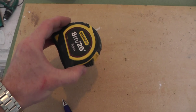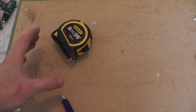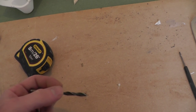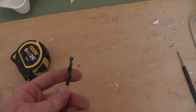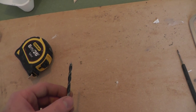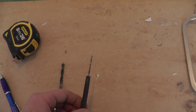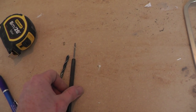Other things you'll need: a tape measure obviously, just to measure out the lengths — though you can do a lot of this by eye, just by holding up and marking, and it's just as accurate. A pen or pencil to mark that. And then a drill bit — a drill bit big enough to act as a countersink. I drill half the way through with this, and that way I can bang in a masonry nail and still have plenty of space to fill and paint over the top. You can use a countersink bit if you want, but the nails tend to go through the moulding absolutely fine. Once the nails are in, a little nail punch just to sink them well into the moulding and make sure you've got enough space to fill over the top.